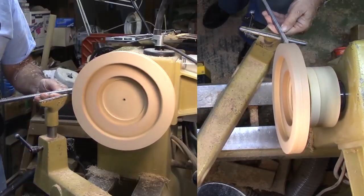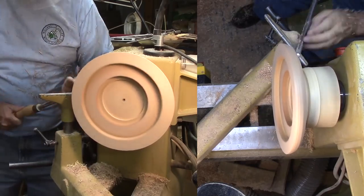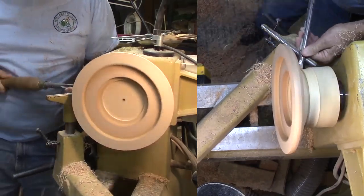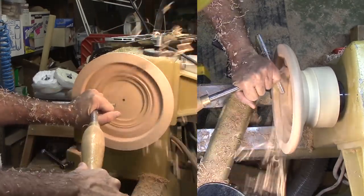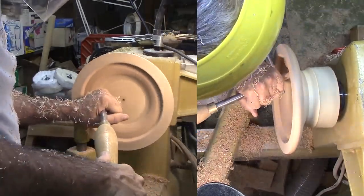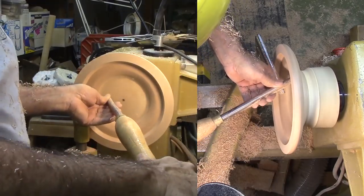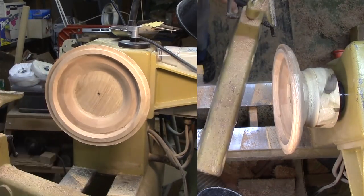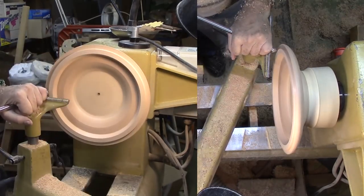Finally, I'm ready to shape the lid starting with the exterior. This oak is hard but still tools nicely since it is all face grain due to the segmentation. With the exterior complete, I can tackle the interior starting with my gouge. There's no problem with vibration with this diameter since the walls are not that tall. After testing to the bowl's bottom section, I can form the edge to be a loose tenon. After the tenon is ready, I can fine-tune the remainder of the lid. After a little more with the gouge, I switch to a round carbide scraper to follow the curve more easily.